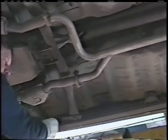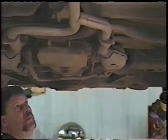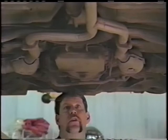I see a lot of newcomers in this business that, yeah, they're cutting their bolts like they're supposed to, but it depends upon where they're blowing the sparks. If you've got a car and another hoist or car down on the ground next to it, you could blow sparks on the windows and pit the windows. Or you might have another worker over there, and that worker might get sparks down his shirt or legs or whatever, and you could hurt somebody. And of course, when these hot bolts hit the ground, make sure you're not standing on those when they hit the ground. There's a lot of safety things to keep in mind. Safety first.